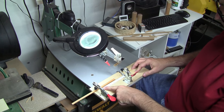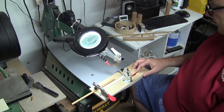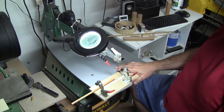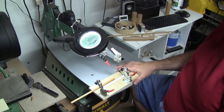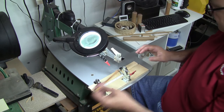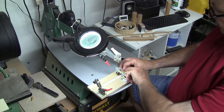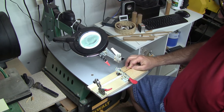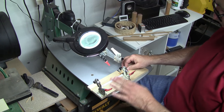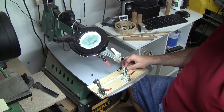I'll draw up some simple plans including the tape measure so you can print it out. When printing, make absolutely certain you're printing at the correct size — use a ruler to check it when done, since prints aren't always accurate. The hold-down clamps are available at Woodcraft and other online sources; I'll put a link in the blog post and in the description below. The hold-down clamp needs to be positioned so it can actually clamp the dowel size you're cutting. For very small pieces under a half inch, the clamp will miss and you'll have to hold by hand — but the jig worked fine before I added the clamps at all.